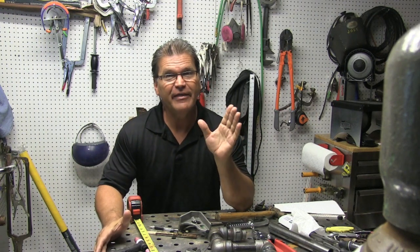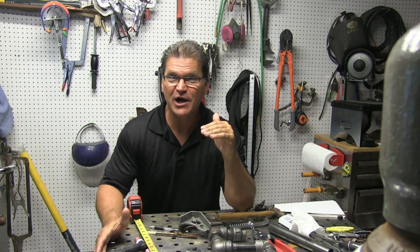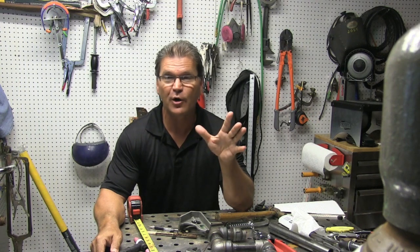Most of the time when I do a video like this — a short production run of parts for a machine shop — I get questions on how do you know what to charge. That really comes with experience, but there is a simple formula that can keep you out of hot water. What I do is charge a certain amount per tack weld along with a certain amount per linear inch. I started out at a buck per tack and a buck per inch 25 years ago when I got my first Square Wave 250, and if I bid it that way, I did really well.